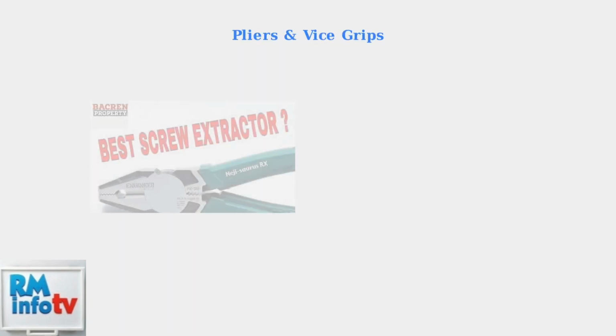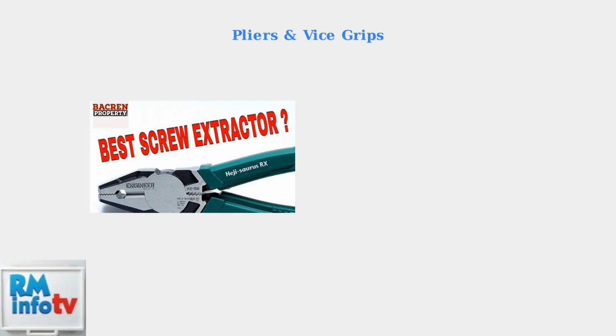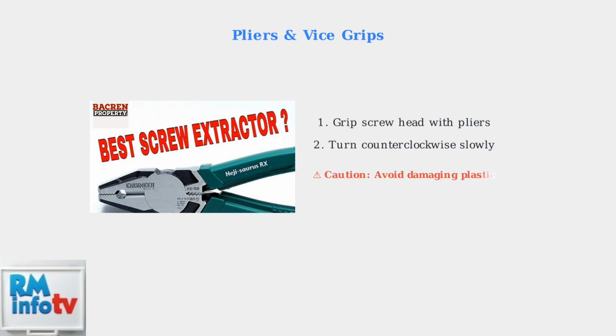When the screw head is exposed enough, pliers or vice grips can provide a mechanical advantage. Vice grips are particularly effective because they clamp onto the screw head with adjustable pressure. Grip the screw head firmly with the pliers or vice grips and turn counterclockwise. Be very careful not to damage the surrounding plastic material, as excessive force can crack or deform the plastic housing.